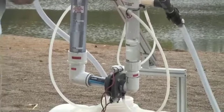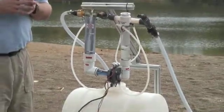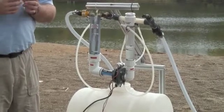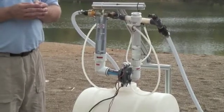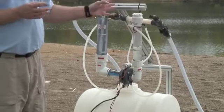So in the tube on the right, you're actually producing a chlorine gas, and that chlorine gas is being siphoned off by the process of that venturi tube. Correct. Into the water that is unpurified, and is flowing back into the tank chlorinated.